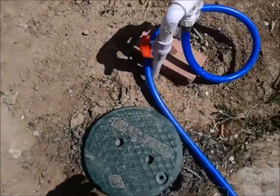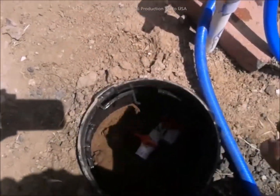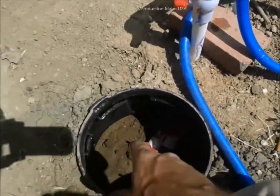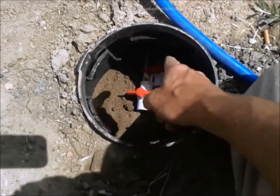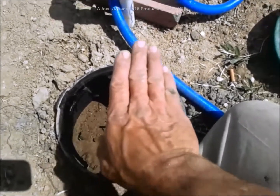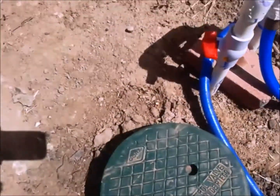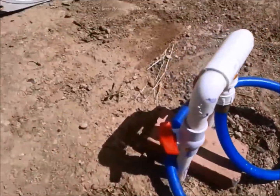It flows down to this box over here. Currently I have to hook it up to the pipe underground — there's already a pipe down there, I just have to chip a little piece of concrete to get to it. In this box you have two drain-down valves so that in the wintertime we're able to drain the water out of the system to keep it from freezing. Everything drains out dry into this box, which has large gravel underneath that little piece of slab, and that way it works perfectly.